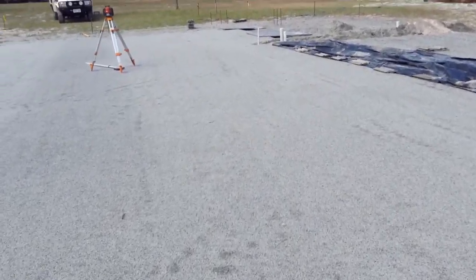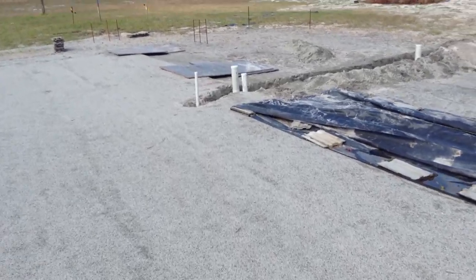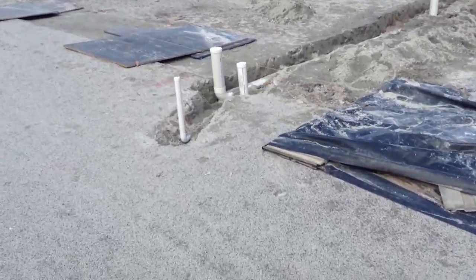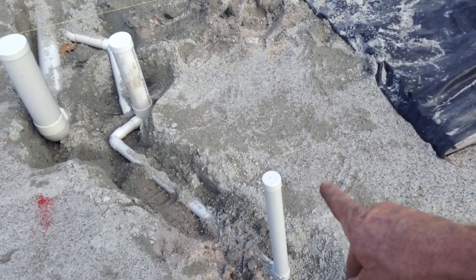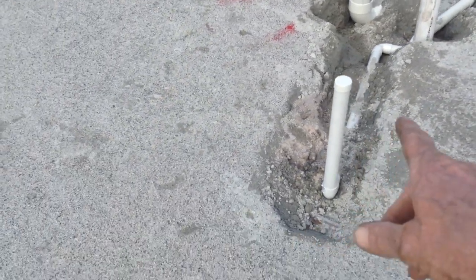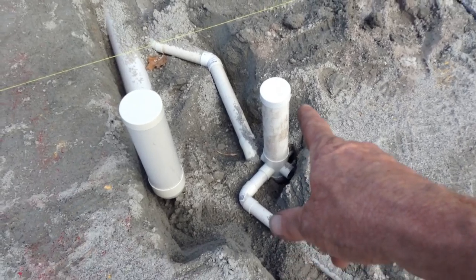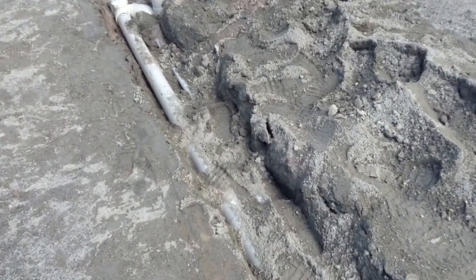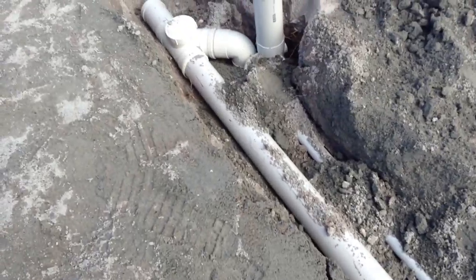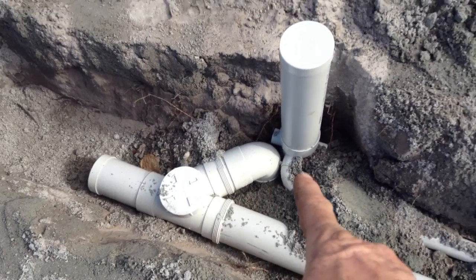Now I just had the plumber in this morning, and he's dug in the pipes for the dunny. So there's the pipe there for the basin inside the dunny, and in the shed wall we'll tee into that, and there'll be another trough in the shed area. There's a floor waste, the main dunny pipe, and that one there will continue on to a leach drain septic system. So we just have an inspection cover there, and that's an overflow.